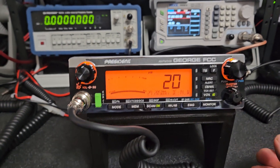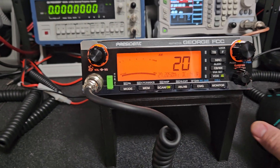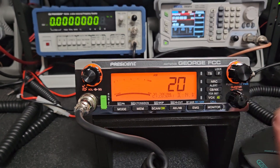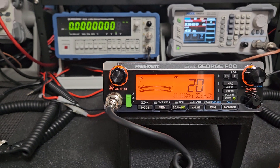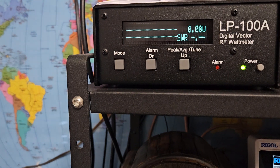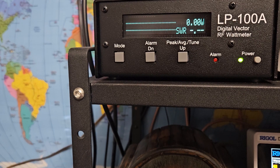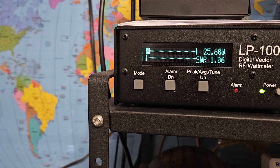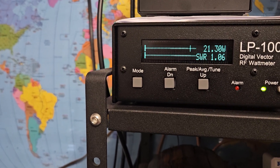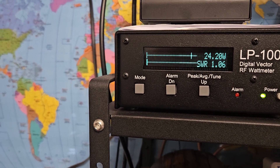Other radios are all gonna drift a little bit, 30-40 Hz, sometimes more depending on what kind of CB radio you have. That's why the whole unlock clarifier thing became so popular - it was a way to compensate for that a little bit. But it's not necessary on this radio, and even if someone figured it out I wouldn't want it on mine. I think it's perfectly fine the way it is. I've got the radio at 4 watts on the dead key on AM, power all the way up, mic about between the O and the L on volume.